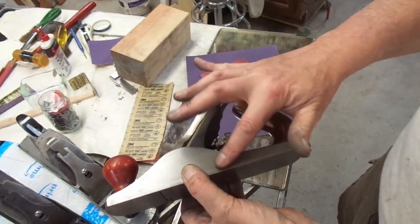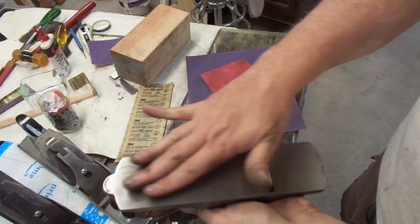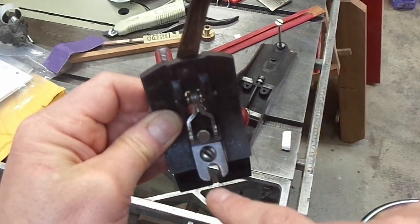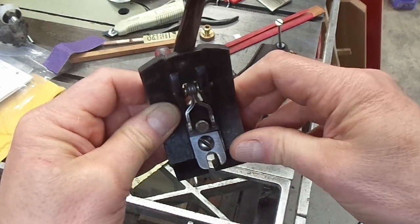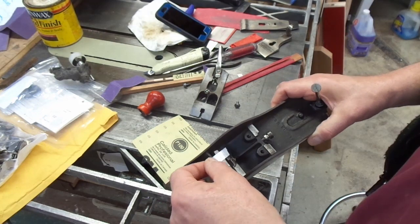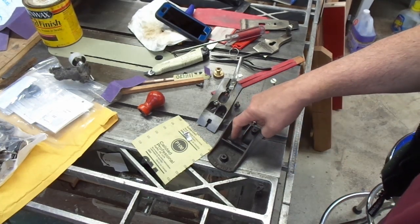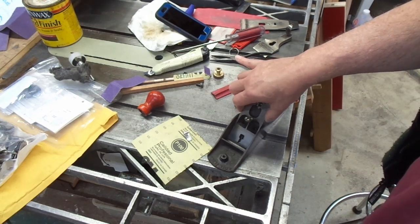It's hard to tell by looking at it if the edges were sanded, so I'll just leave them dark. This probably only took about 10 minutes — spot sanding mostly — you can still see a little bit of the graying, which is fine. I also touched up the bottom with 220, hitting a couple of spots to polish it up. The frog adjustment screw was off center — there's a shoulder showing on one side of the tab and not the other. The tab is ground at an angle and the slot isn't symmetric; it's kicked off to the right. I had originally mounted this backwards, which I think was causing problems with the frog. To check the frog seating I used a piece of aluminum foil — one thousandth of an inch thick — underneath each of the four tabs, pressed the frog down and tried to lift the foil out. It was hitting on three points but not the fourth, so I took time to sand the relevant surfaces until I got decent friction on all four points.